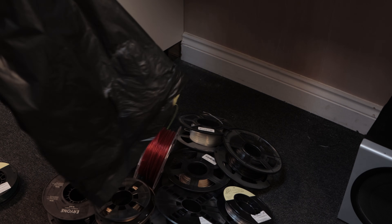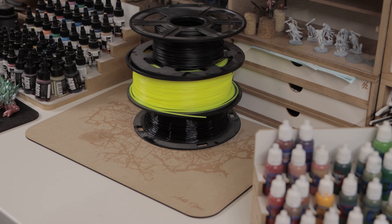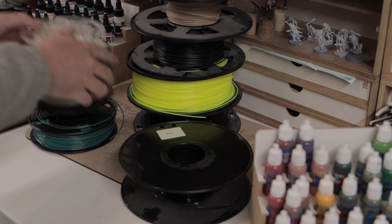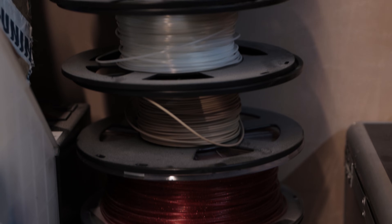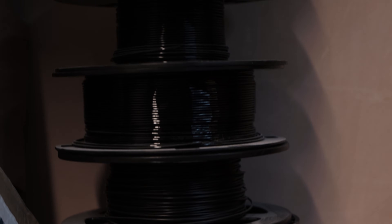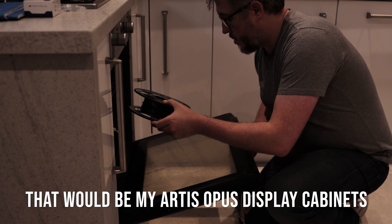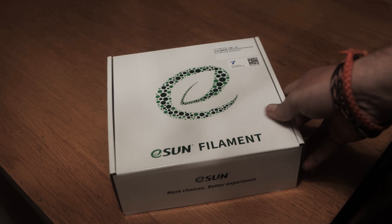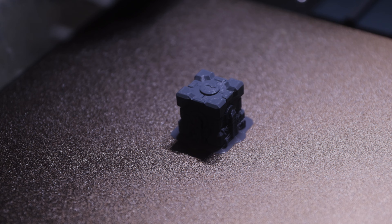The problem was me — I was trying to be cheap. I don't think this is an unrealistic scenario: if you've just spent two or three hundred dollars on a 3D printer and your mate's got some PLA handy, you're going to take it. But it turns out PLA can actually absorb moisture. Forgive me for thinking otherwise, but everything I've known that repelled water has normally been made out of plastic. And whilst you can apparently sort this out by putting your PLA in the oven for a bit, as a beginner and as somebody who's recently upset the wife by installing miniature things in our kitchen, I didn't want to cook plastic in the same place we feed our kids. So when I decided to go out and buy myself some eSun filament, it worked straight away. No problems — I got this off the print bed without any issues.